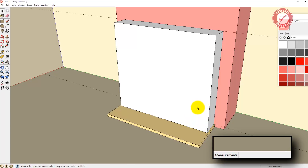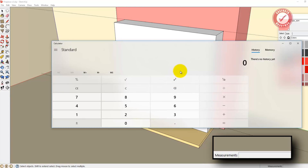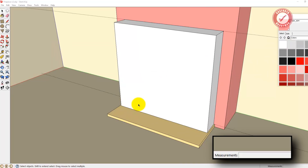This has to have three levels of inset on it. 220 minus the depth of the mantle back - the mantle back I know is 25mm thick - so 220 minus 25 is 195, divided by three is 65. I'm just making a note of that because I'm going to need it. You'll see where I'm going with this - it's how deep each of the little sections are going to be, because it has to go in by equal thirds, stopping at the mantle back.